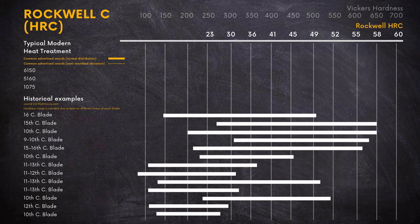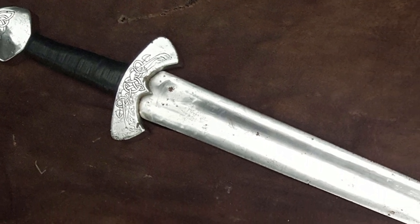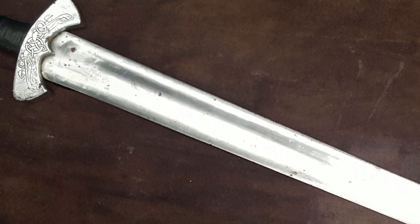The data shows historical swords had HRC — a Rockwell C scale rating — that ranged from a soft 20 or less up to a very hard and slightly brittle 60. But to achieve a modern balance and as close to perfection as we can, we aim for around 50 HRC today. Even if you get a perfect sword that has a soft core and perfect Rockwell on the edge, breaks can still happen.